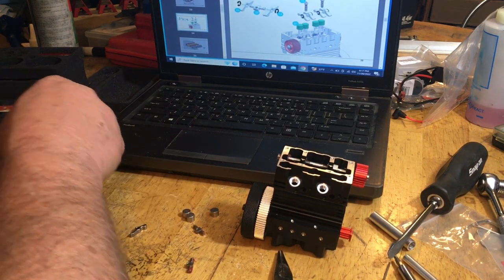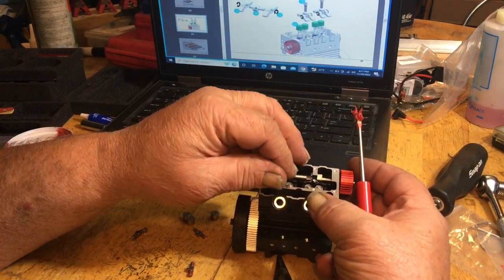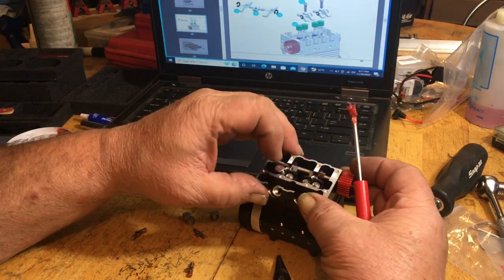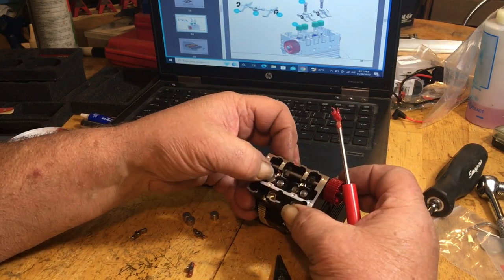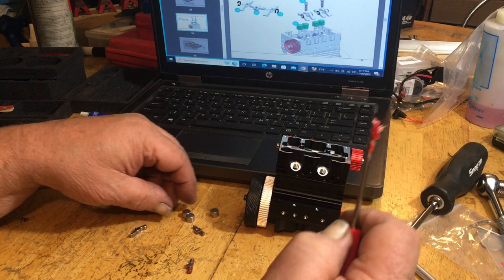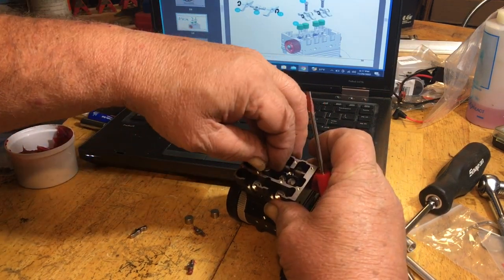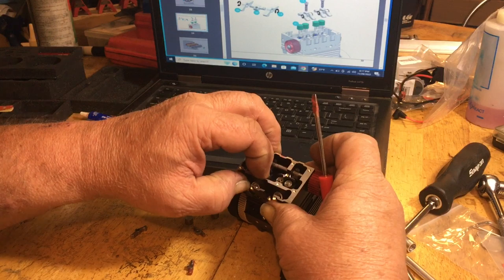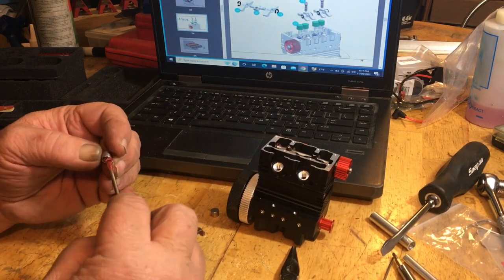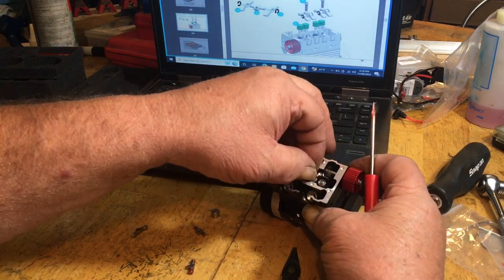I fill them right up and I squash them down on there, because these engines have no valve seals in them. And the only thing that I think really keeps this engine running, because to start these engines up for the first time, there's so much friction going on there. When you squish them down, the grease squishes out onto the sides and it's all good. It keeps the compression within the cylinder wall. There we go. Now, it'll eventually be a little bit funky when it first starts, but once the grease beats itself out of there and turns to a lubricant,